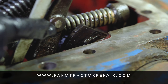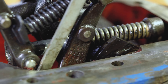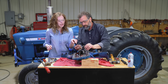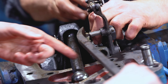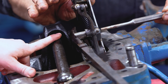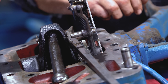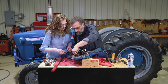The next thing we're going to do is replace the pivot pin. If your tractor lacks draft control — meaning it really only wants to be all the way up or all the way down with no in-between position — go ahead and check your pivot pin and see if it's worn. It rides on this cam and with a lot of use they do get worn. To remove it, use a socket that's just the right size to wrap around it, come around the front with a pry bar to hold it in position, and drive it out with a punch.